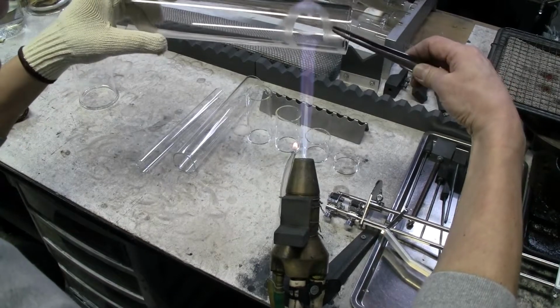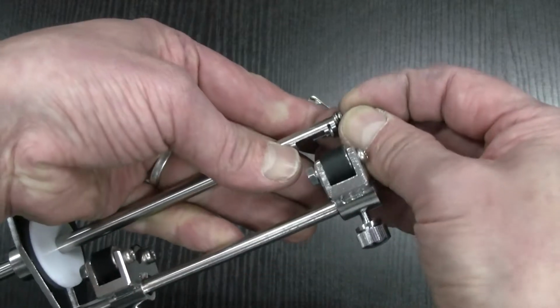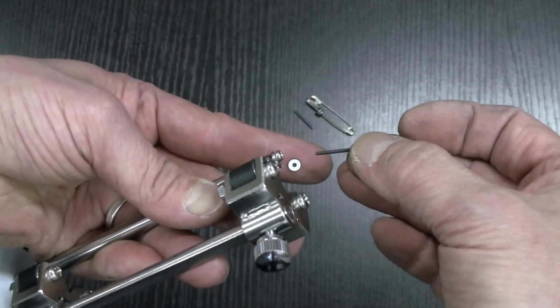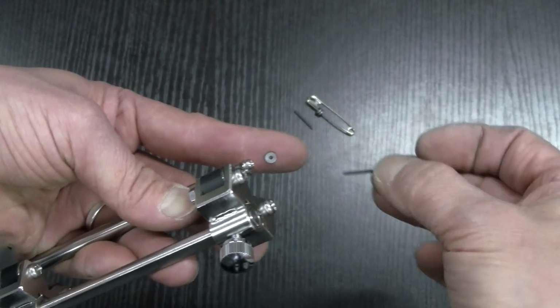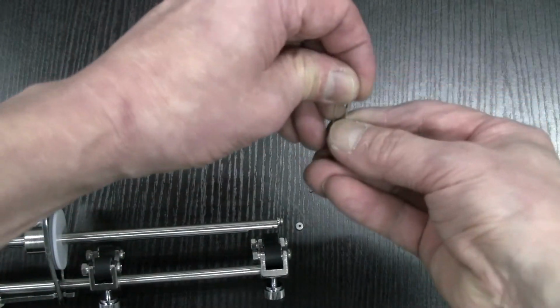7. After many uses, you will find you must compress the handle harder to get a shiny fracture line. The cutting wheel may be greasy. Please wipe clean with a solvent and rag. Never apply oil or other lubricants to the cutting wheel. 8. If excessive pressure is still required to produce a fracture, or the cutter goes from no fracture to a wide white crushed line, the cutting wheel is worn.